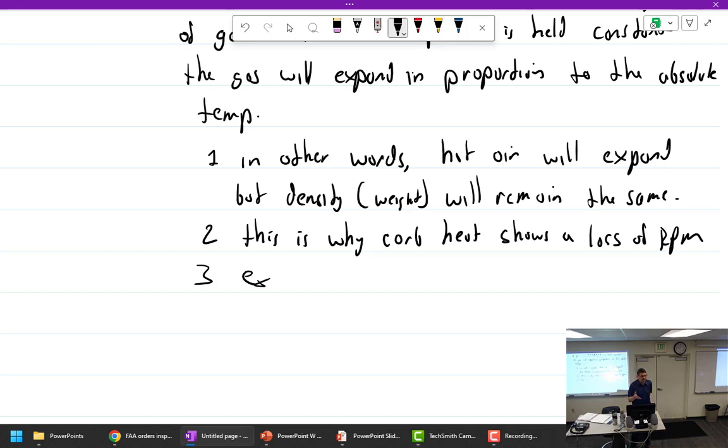From a pilot perspective, when we talk about density altitude, I listened to the AWOS, the Automatic Weather Observing Station, here in the middle of summer, and it says caution, density altitude 3,000 feet. That's a high density altitude, meaning high altitude. That's bad because the density of the air went down, so the density altitude went up. Follow? It's like a higher altitude. Is that maybe how you got those crossed?